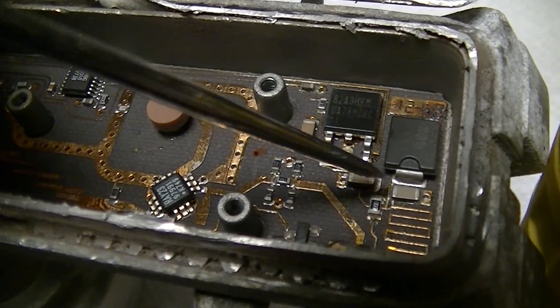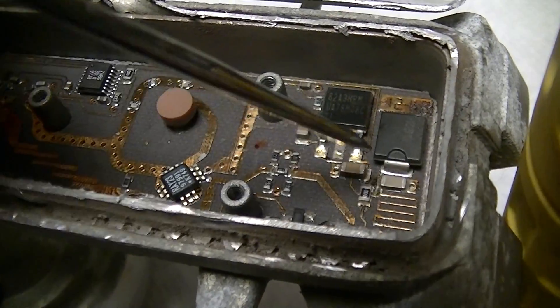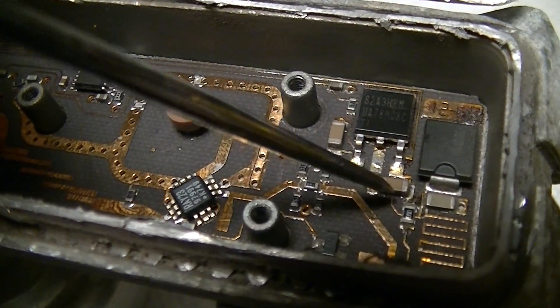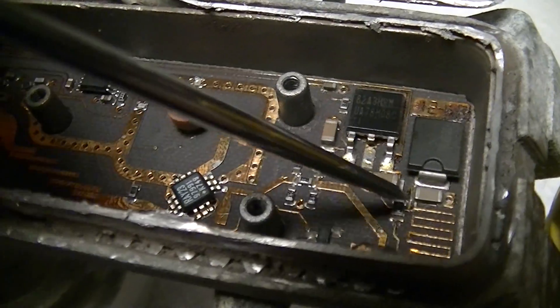There's an 8-volt potential regulator. A couple of caps that form a passive LC filter, just to keep RF and crap off of the DC supply line. That supplies through one trace, through that cap, but that's presumably ground.